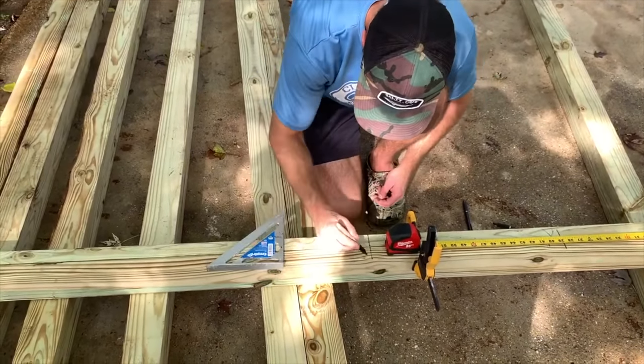For example purposes only, let's take a look at a shed that extends 12 feet horizontally and 2 feet vertically. In this example, when you convert that to inches, the shed roof rises 24 inches over a 144 inch length. In other words, this shed roof will rise 2 inches for every 12 inches that it extends horizontally. This equates to a 2/12 roof pitch, which is the same roof pitch we're going to use for this shed.